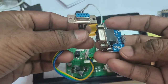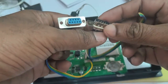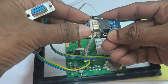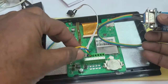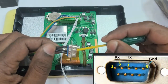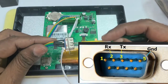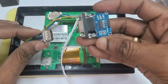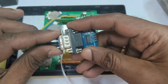Now let us see how to connect with Arduino or STM32. For this we require a male D-connector at the DWIN side, because the RS232-to-TTL board available in the market mostly has a female D-connector on the other end. Let us change the connections to a male D-connector with the DWIN. The connection is straight: TX to T2, RX to R2, and ground to ground.